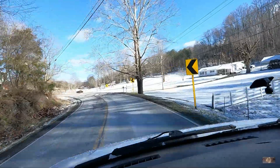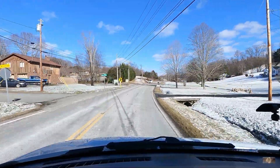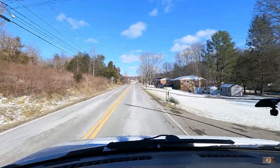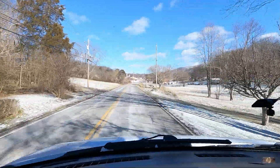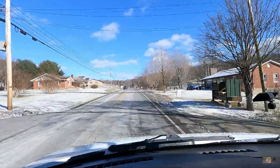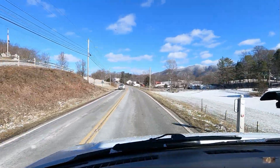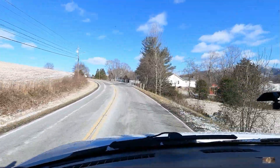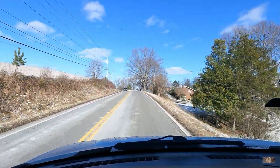I wish I would have been able to check the charge. I checked the temperature split — the ductwork down there in this old farmhouse in a neighboring town is pretty bad. They had about a 60 degree temperature split with that 10kw heat kit going and the 2.5 ton heat pump — so they're really just not moving enough air through that system. They just can't afford it right now. The guy's got to put in a new water heater on Wednesday and he's going to have the whole house replumbed with PEX piping — I think he told me that's going to be around $6,000 to $6,500. So he's strapped for cash — that seems to be the common thread around these parts. Most people are pretty hurting for money. It's rough out here — everything costs a fortune.